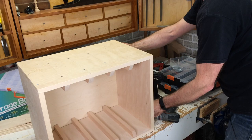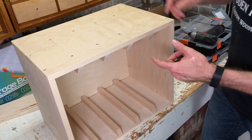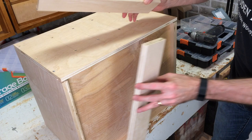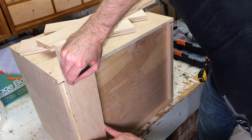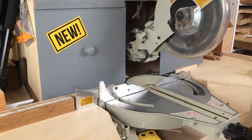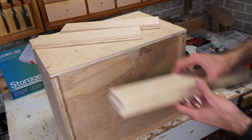The last component are the nailers. I need to put those on so I can secure the cabinet to the studs. These are three-and-a-half inches and one goes on each side. But I cut them too short — I forgot that I had a rabbet in here from those panels on the inside. Now that's better.